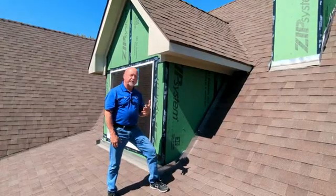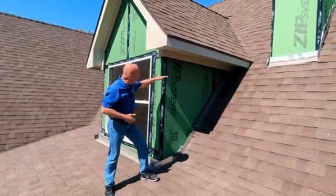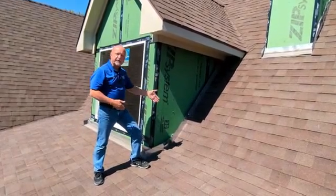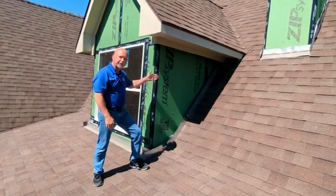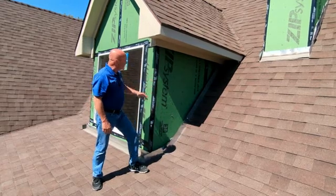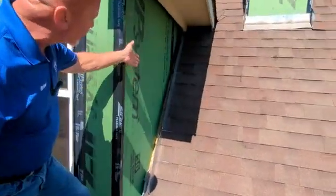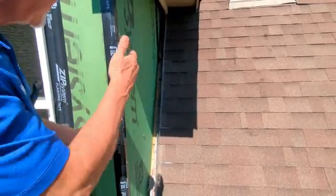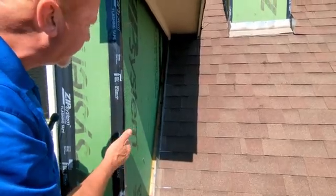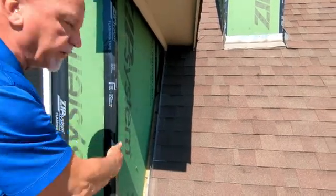So we're on the roof area, and we're still going to be talking about the installation of stone around the house. On this particular area, from the architectural designs and from the way they had the step flashing set away from the wall, we know that they're going to put some type of stone or some type of veneer cladding in this area that's going to leave a gap on the back side. So when we see that, we want to make sure that there's a proper drain plane. If you look down in this area right here, you can actually see the decking of the roof. So if they go to apply stone right here and they don't put a proper trough in or flashing details in, what'll happen is moisture will get through the grout in the mortar of the stone and eventually run right into the house.